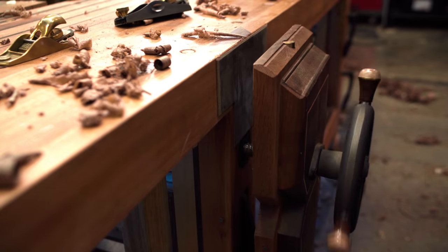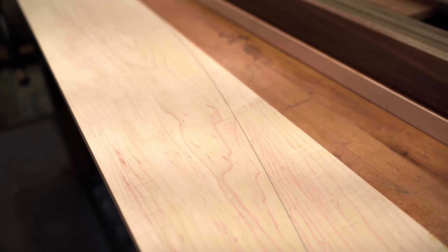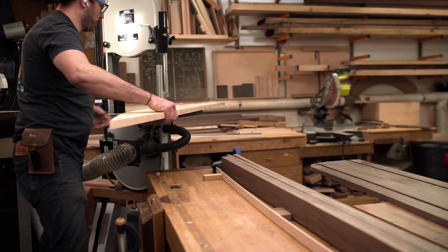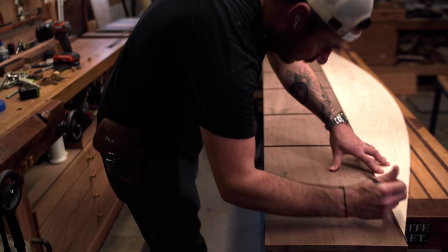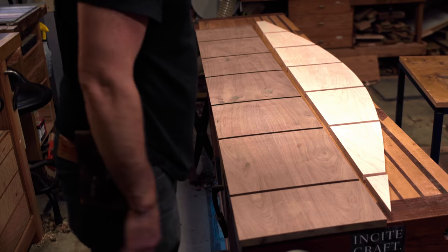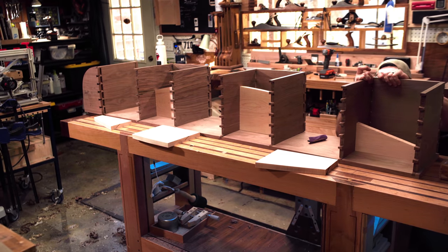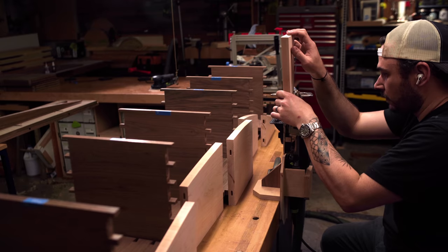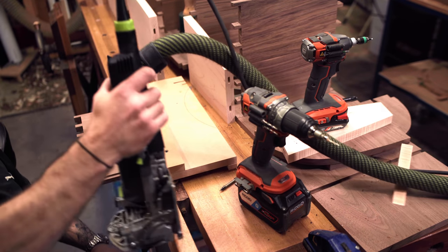Last thing is the O-shaped strong back that we're putting on the inside of the center stack — we segment that out, put it inside the boxes, and use domino joinery floating tenons to get it going. There was a bit of a mood change here: it was 118 degrees in Portland, Oregon, which is just ridiculous.